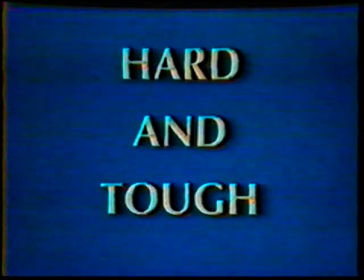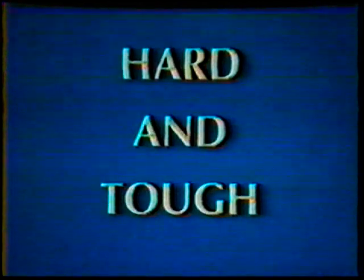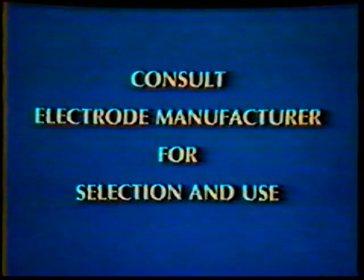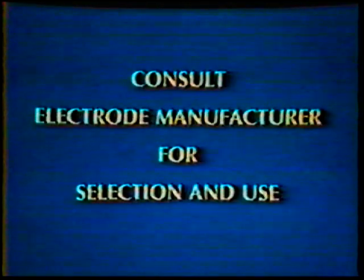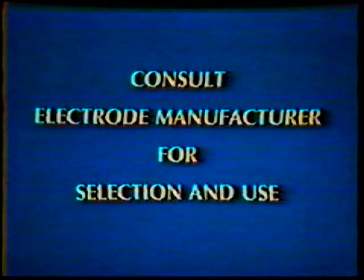Electrodes are available in a range that varies from tough to hard. In the middle range, the material has some of the hardness and some of the toughness. Manufacturers of surfacing electrodes provide excellent information to assist in selection and use of the correct material or combination of materials. A typical example of one use is on the bucket or dipper of a shovel, backhoe, or drag line.